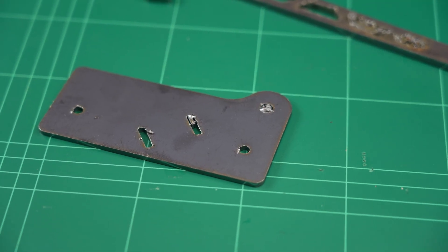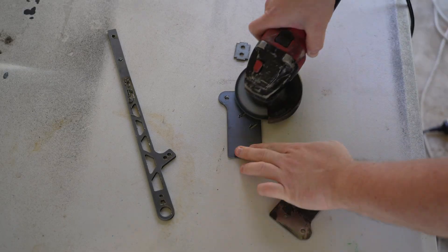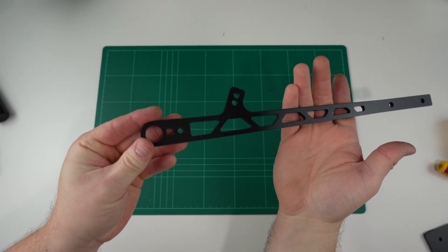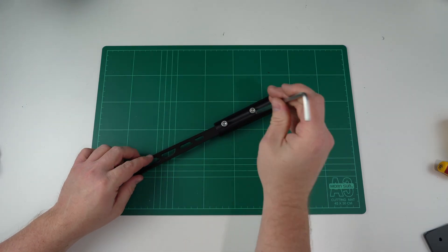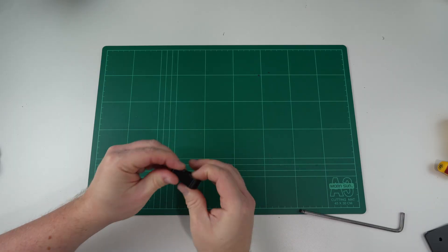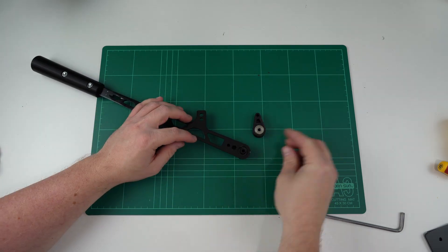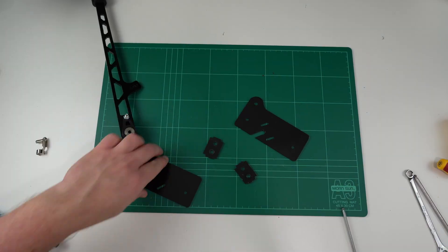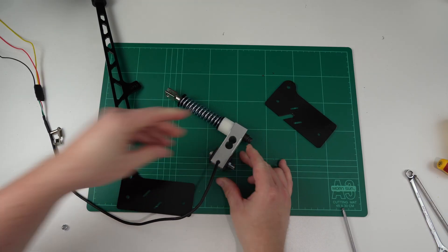Now let's get started on the laser cut version. I've kept the geometry the same as the printed version, so the handle length and the distance of the load cell to the mounting point are the same. First, I'll laser cut the lever out of 5mm steel. The laser wasn't cutting quite as well as usual, so this part needed a bit more clean up than normal. It cleaned up nicely though, and with a combination of etched primer and gloss black paint it's looking the part. The handle is just 3D printed in PETG and slips over the top of the lever, attaching with two bolts. At the bottom of the lever, there are two 3D printed mounts for the same 625 bearings we used in the printed version, which press in from either side. These parts were printed in PETG on the strength preset and slot into the arm then bolt in place. The base of the handbrake is made up of four 3mm laser cut plates — the two smaller plates go on either side of the load cell and slot into the larger plates.